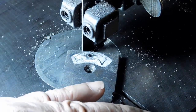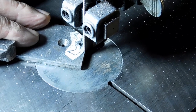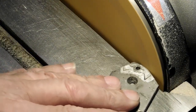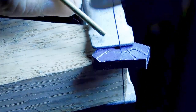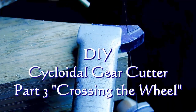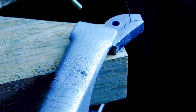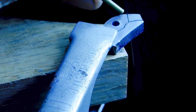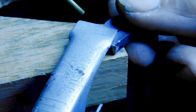I glued a piece of paper to a piece of cold-rolled steel and I'm cutting out a basic shape on the bandsaw — the important part is that angle we just marked. A lot of the backside of the click can be sanded away, so I'm at the disc sander taking it down to the line to save time. Then I remove the paper, apply Dykem, and use a piercing saw to cut the final shape. I have a video on crossing wheels that shows how I use the piercing saw. I'm blowing air in there because I'm working behind a large magnifying fluorescent light so I can see what I'm doing — as you get older that kind of thing becomes pretty important.